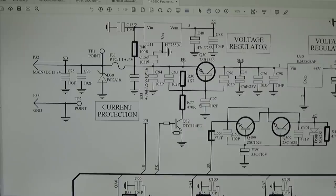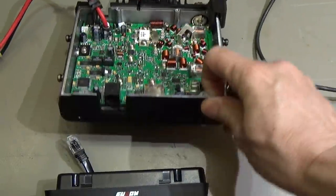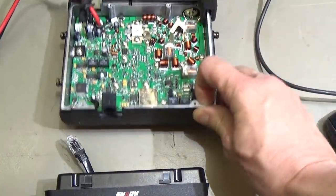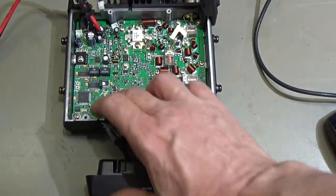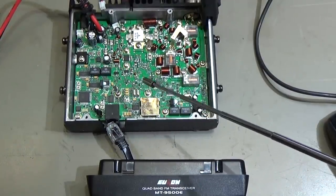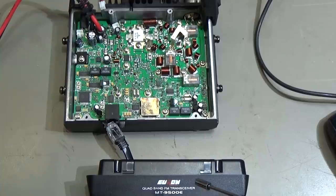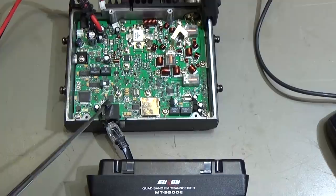Because, as we discussed, we should see a voltage at our front panel connector, right? Here, of course, is our front panel connector, which connects our user panel with the main unit, and that is the connector where we need to have a voltage. Otherwise, our radio is not able to deliver our PK voltage, which we need to engage our entire power supply, right? So let's check where the voltage should be present at this connector.